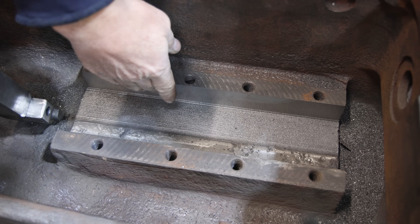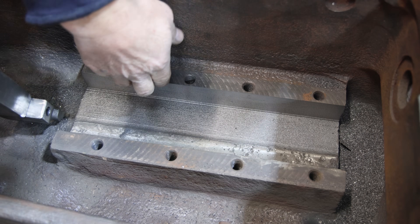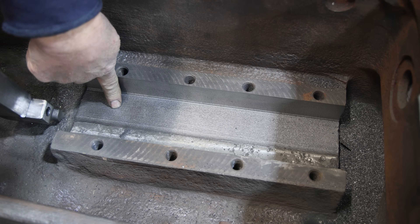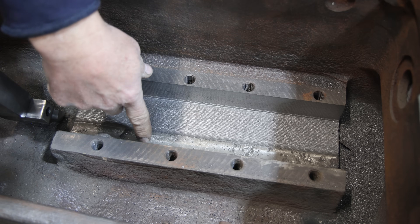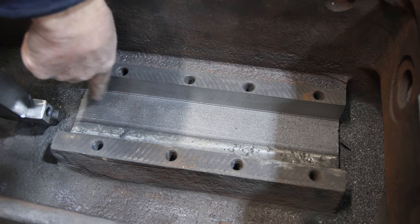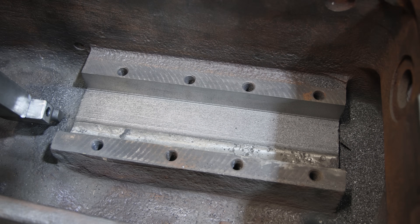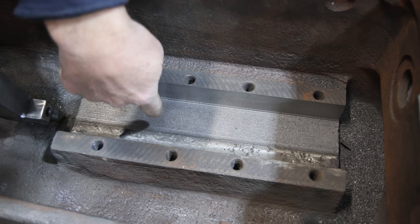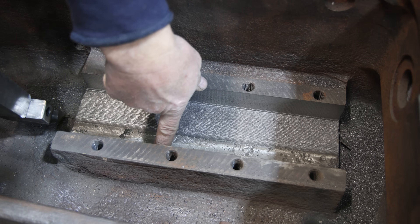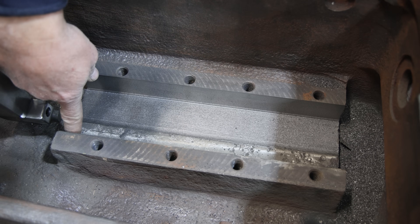When we left off, I had planed down this side and got a nice finish all the way down. We started across the bottom — I've just been roughing this, it's not a finished surface by any means — but I did get it cleaned up. I'm having to get down into some fresh material below some pitting that was in there, and there are still a couple of spots that need cleanup. Now I want to flip my cutter over; I've had to work toward the wall, but now I need to go the opposite direction because the way my cutter is angled, I can't get all the way up to the shoulder.